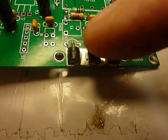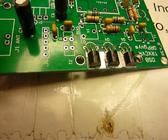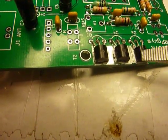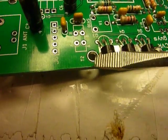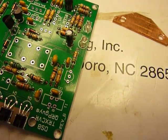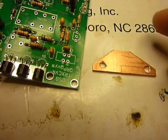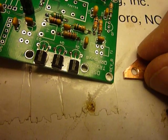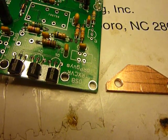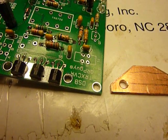I'm going to tighten the nuts just tight enough to compress those split ring lock washers, which will then act as compression springs and keep a tension on the three final transistors. I've added heatsink compound under each one, and this continuous compression with this piece of copper — which is certainly a better conductor than a paper clip — is what I'm doing here. This is part three of the assembly of the QRPGuys DSB transceiver. 73s and good DX.